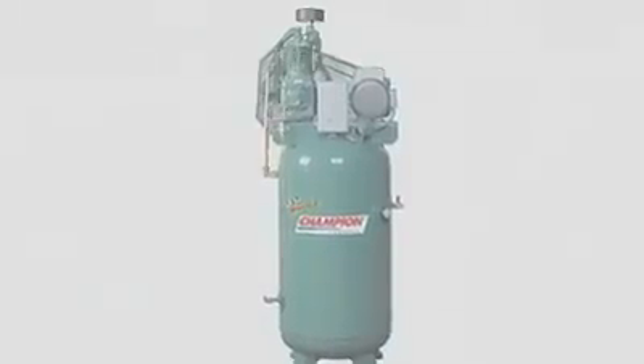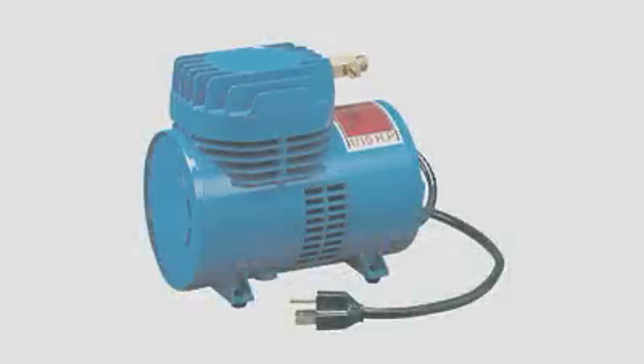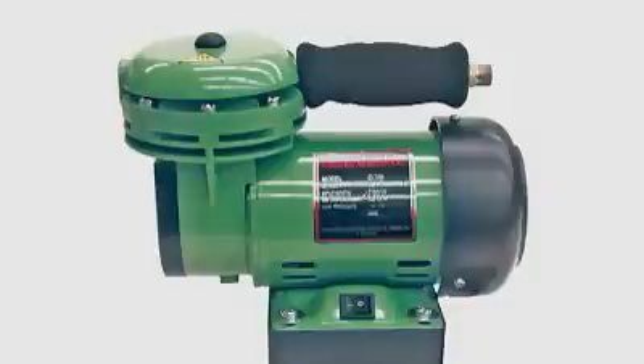Second, you'll need an air supply source for the gun. From large projects to small, the hot coat gun requires very little air. Just 0.5 CFM at 5 to 8 PSI works fine. You can even use a portable air tank with regulator.